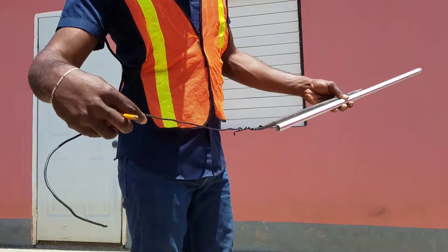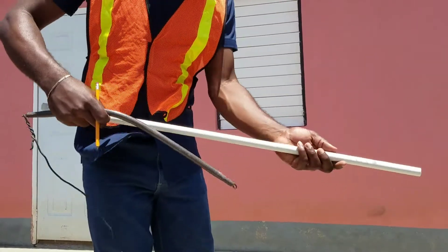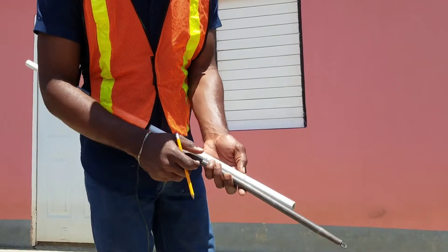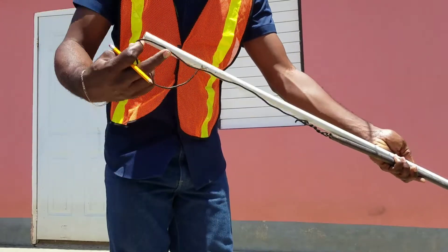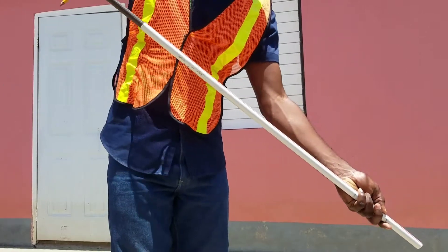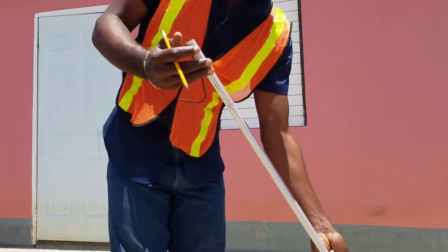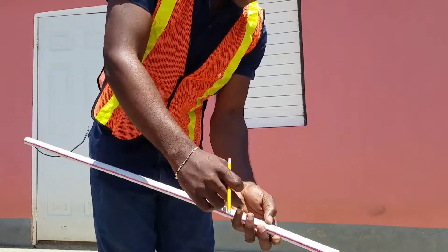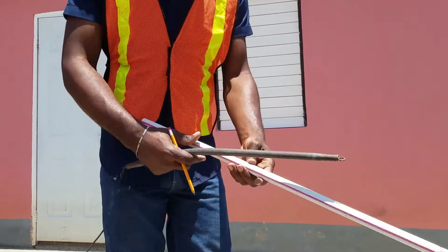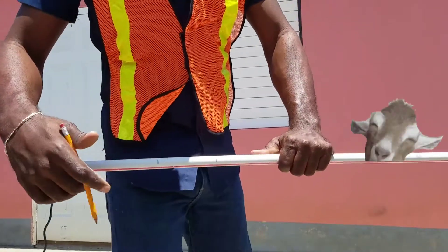This is also why we have this piece of wire on the spring bender — because if this was a long piece of pipe, you would enter the spring bender from one side and you need to know that it has covered the area where you want to make your bend or offset. You measure and mark that point. But since this is a short piece of pipe, we can just insert it from this end and we are good.